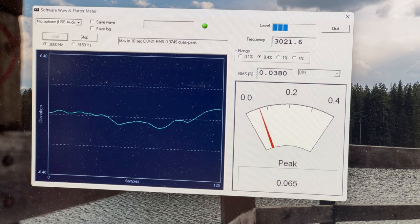But I just wanted to mention for playback level, which we are going to be doing on camera, JVC wants you to do that using a special test tape that's done at 1 kilohertz, and they want you to adjust VR101 and 201 until the lineup becomes about -4 decibels. I've got a better way of doing that than JVC has it here, and I want to talk about that real quick, because I've never used this method before.